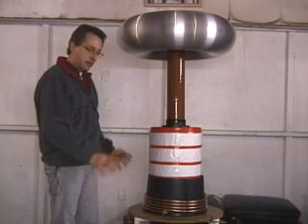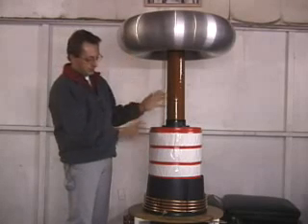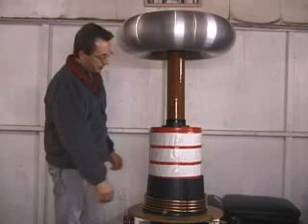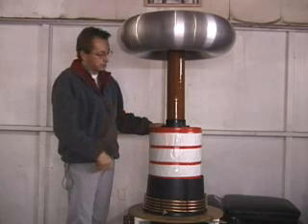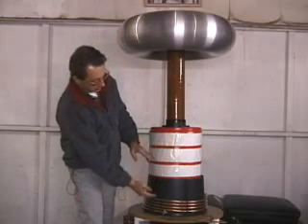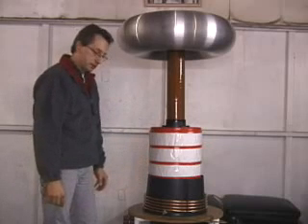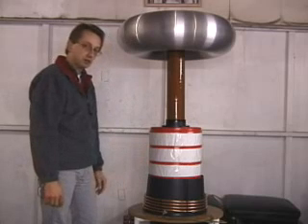I ran that in Java TC and was able to actually adjust the number of turns I would need on the driver, considering everything in its relative position and how each part affects the capacitance to the driver coil and therefore the resonant frequency. I figured out I needed 250 turns, so I took this coil and unwound it until I had 250 turns — there were about 350 to begin with. The actual height of the turns on this form is 10.4 inches, and the last turn I slow-wound it, extended it all the way around and up, and connected it up here. For the primary, I ended up needing 4.7 turns with a 0.06 µF capacitor bank.